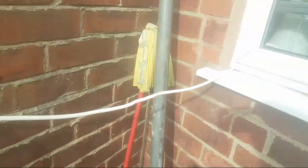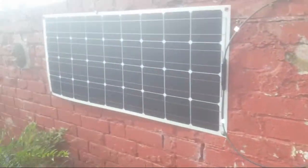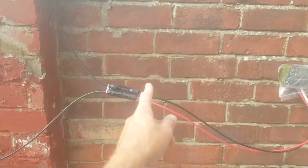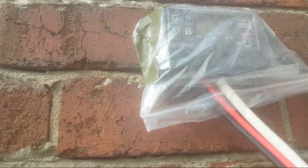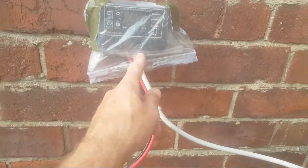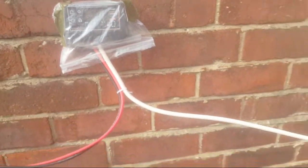The white cable feeds out to the battery. Outside we have the Power Catcher 100 watt with solar panel cable extensions, with the raw ends going into the bottom of the controller. The output of the power pack is giving a 12.6 volt reading on the display, and I'll show you the cable coming out of there going down.